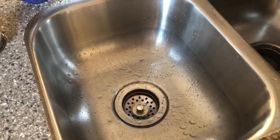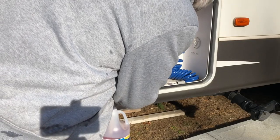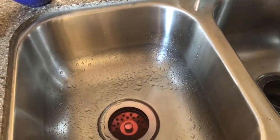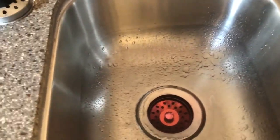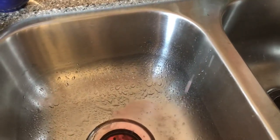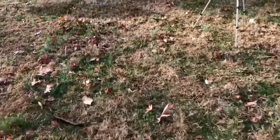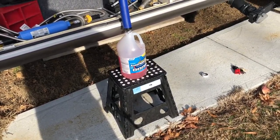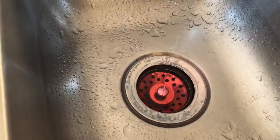There's a little antifreeze. Alright, now we have antifreeze — you can see it dripping out of the faucet. Now we're going to turn the cold off. That was hot water. We turn the cold on — we already have antifreeze in the cold, but we'll pump a little bit more just to make sure. That little bit that ran out of the faucet when I turned the hot off was really just the antifreeze that was up in the faucet. Now we pump some to fill the cold water line running to that sink — yep, we got a couple drips coming out of the faucet.